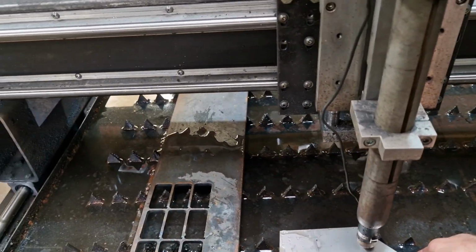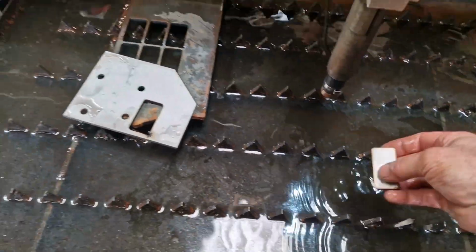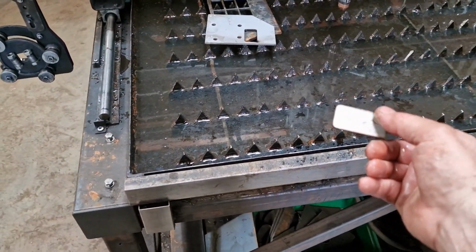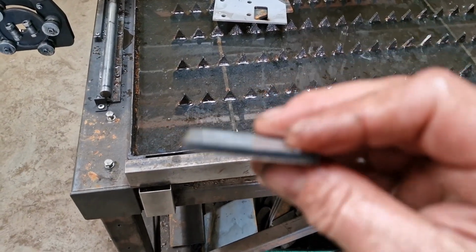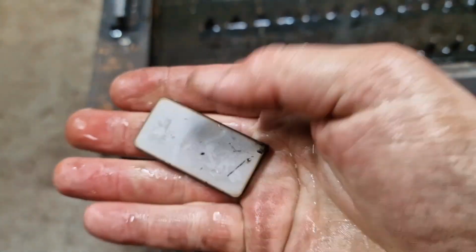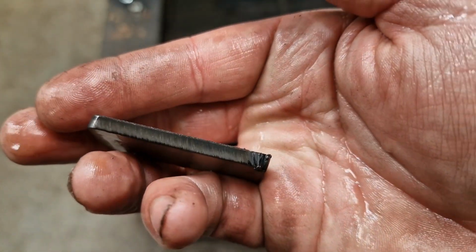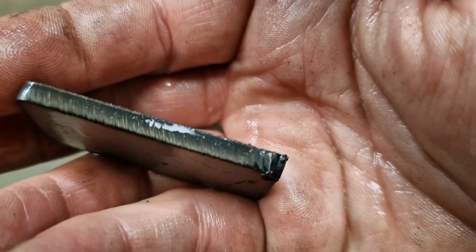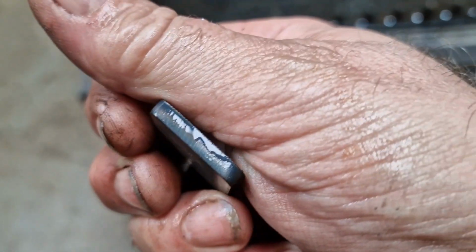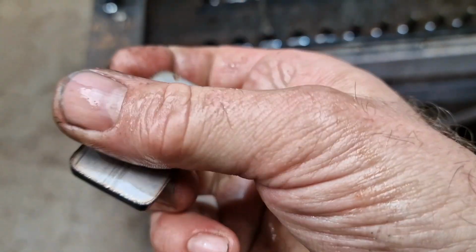Now let me fish out the piece of stainless. Oh, yeah. Oh, cold, wet, and horrible. Okay, let's have a little look at this now. So this is our 5mm stainless cut. It's okay. If you look at the edge, I don't know whether we can see that, whether it's going to focus. It is a lot cleaner than air only. But you can even see, look, it's a nice bluing there, so that's a properly clean cut.